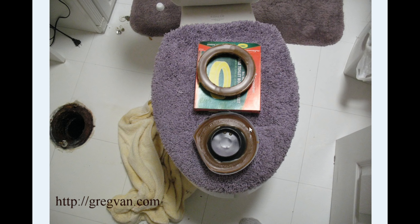Here are the two wax rings. You have a wax ring with a plastic flange and one without. I don't recommend using two wax rings with a plastic flange. You can use one with a flange — install that one first — and then one without a flange on top. Here you can see the base of the toilet flange is clean; we're getting ready to put the first one on and then the second one on top.